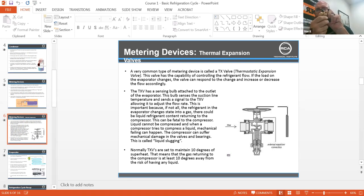Here's the inside guts, showing the spring — just like Jim said. This is a mechanical TXV; there's your spring. If you pull the top off, there'd be some pins on the top, just like Jim was talking about. And here's the bottom piece of that valve with the stem down in the cap.